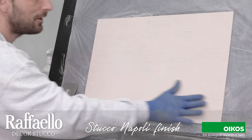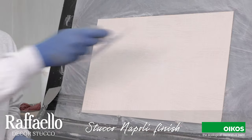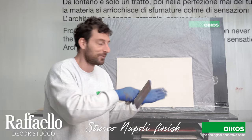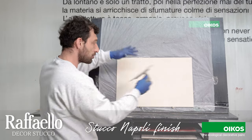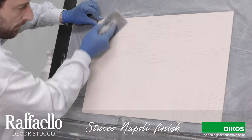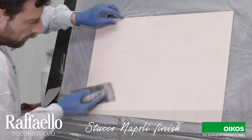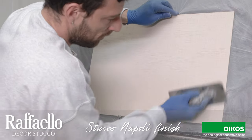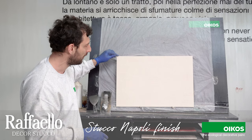We are ready now to make the last coat. You can see the panel here that is completely dry. We are going with the trowel on both sides to gloss the top of the texture. As an option, you can make a first gloss when the panel is not completely dry and is still a little wet. So we are going to gloss with both sides in every direction. As you can see, the top of the texture now is gloss.